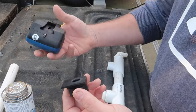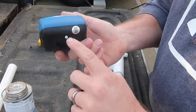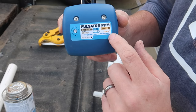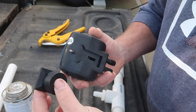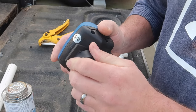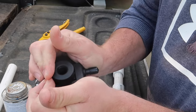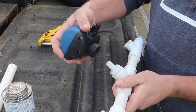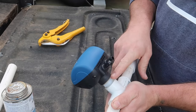The pulsator adapter slides onto your pulsator — whichever pulsator you choose to buy. This is an adjustable pulsator so you can set how many pulses per minute for sheep, goats, or cows. It slides into the location on the manifold — it has a rubber gasket and you have to push pretty hard to get it on. Some pulsators are a little easier, but you want to slide it all the way on to make a nice tight connection. Then the last thing is to put the pulsator on top of your barb fitting so that connection is vacuum tight.